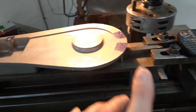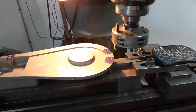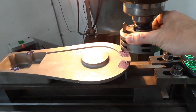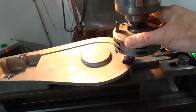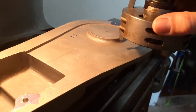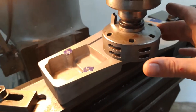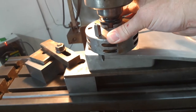I'm testing it so I've not got the auto start on the spindle, but I've done everything else. When I start the program, obviously this will be running a little bit slower when it's cutting because I don't want to be cutting it at this feed rate. I just want to make sure that the tool clears this centre boss, because I don't want to take any height off that boss, but at the same time I do want to make sure that I'm covering all of this surface here — which should be quite easy because the tool is enormous. You can hardly miss it. It's hardly a precise program at this stage.